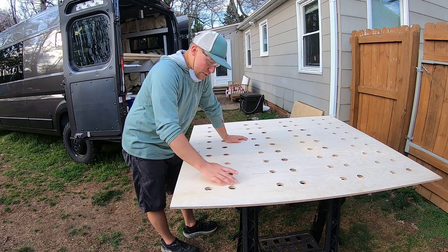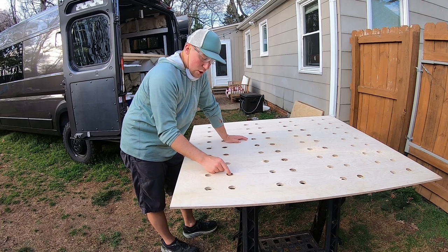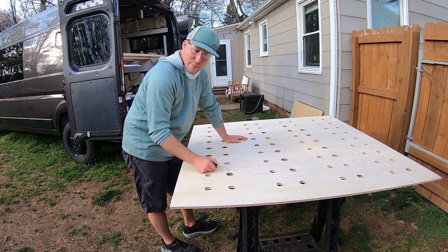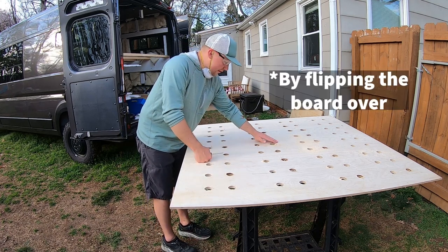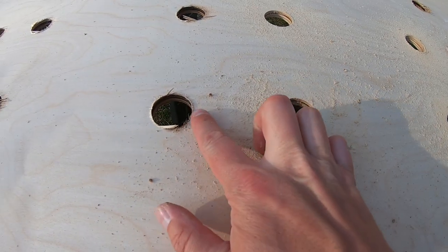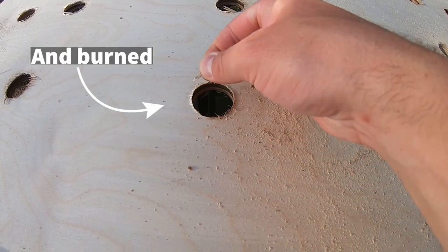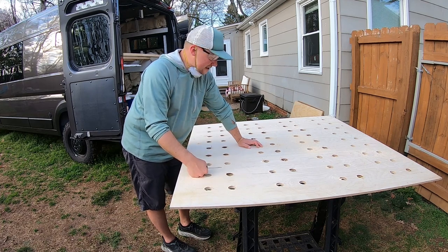Alright, now that I'm done — pro tip. Go halfway through the board, and then the head of the drill bit is coming out, and then you can just go ahead and go the other way. So this is one that I did from both sides, and there isn't a single tear on that, whereas all these other ones are splintered like crazy. I would definitely suggest going halfway from one side, halfway from the other, and you'll have a nice clean hole.